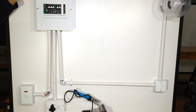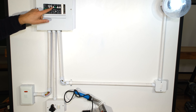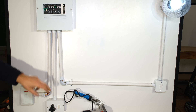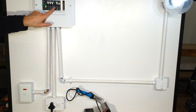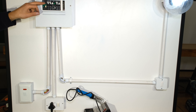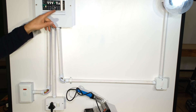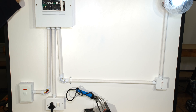I've switched on the DB board which is feeding this DB board. When I lift the circuit breaker I can switch on the light — there you can see the light going on in the top right corner of the video. The light is now energized, so if I switch on and off the light you can see it's now working, even though the earth leakage is still off and the plug circuit is still off. If I want the plug to be on I need to lift up the earth leakage and lift up the plug circuit, and there's the little light for my soldering iron on — so my plug circuit is now activated. Notice when I trip this earth leakage and switch off the plug circuit, the light remains on because that is still connected. If I drop this circuit breaker notice that everything switches off — even my plug circuit is now off. Now if this plug circuit had to trip because somebody touched the neutral onto the earth it will drop that earth leakage, but the light and the geyser will remain on. That is how you wire a DB board with two neutrals. Thanks for watching and cheers.